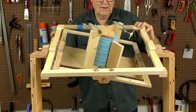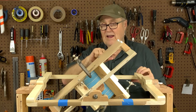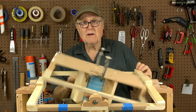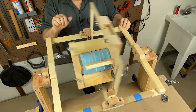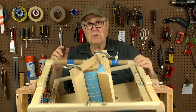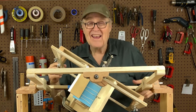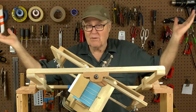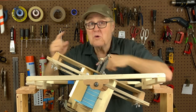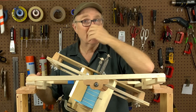As a general rule, this thing is rotating really nicely in both directions. This thing is pretty heavy, but if it's balanced it doesn't matter how heavy it is — this frame can carry a lot of weight as long as it's neatly balanced. In rotational molding you're not spinning at high speeds; this thing is not going to be whipping around at 800 RPM. Contrary to all the comments I get, it's not centrifugal force — that is 100% wrong.